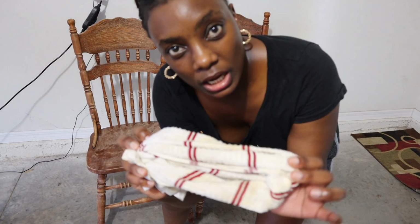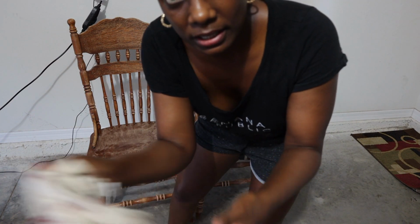It won't happen. So I just got finished sanding down the 2 chairs. I sanded, it was a light sand really. And so the next thing, I need to wipe the chairs down from all the dust, make sure there's no dust, no debris. And then after that, I'm gonna do the wood filler, and then I'll get back to you, so stay tuned. So basically what you're gonna be needing is a rag and some water, and I just wet it and just wipe them down.